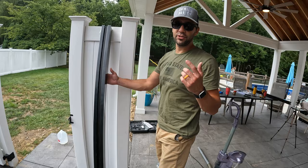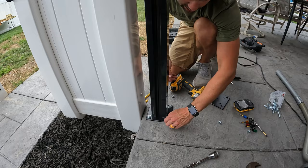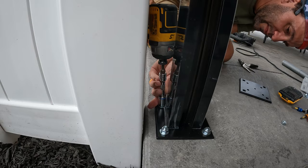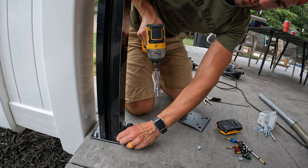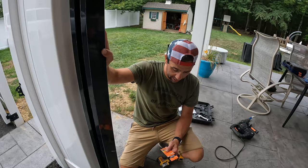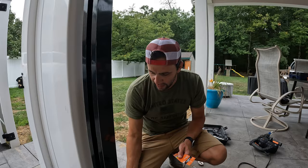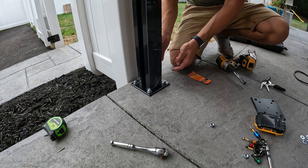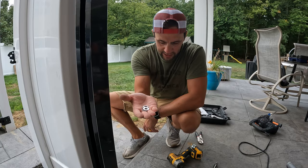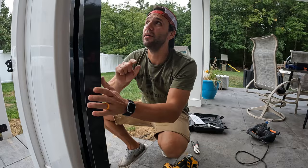So now we're going to install this over the screws and put our washers and nuts on. When we attached this it was a little out of plumb. What I did was I bought these stainless steel three-eighths washers — you can put them underneath the bolts to make a little wedge and push the post whatever way you want. This is stamped concrete, so it's not perfectly level and has some variations. Pick yourself up some of these — if you don't use them you can always return them — but you can use these washers to really plumb these posts in all directions.